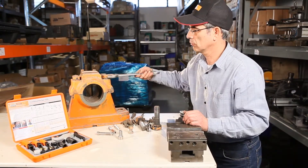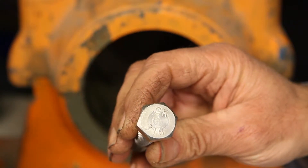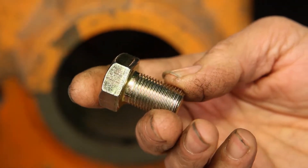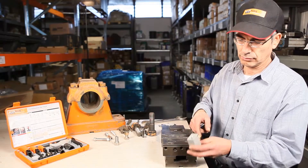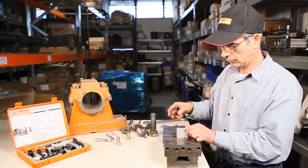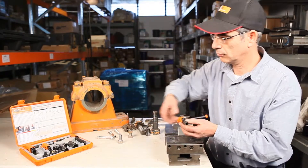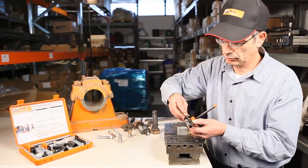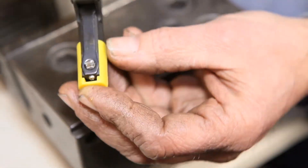One of the first steps that should be taken before starting a job is to know what kind of material is involved. For example, when working with industrial shafts, expect to work with harder materials. In the automotive industry, materials will most likely be made from aluminum cast that is softer and needs to be threaded with care. Internal threads made from aluminum, brass, or any soft metal should be repaired using the internal thread repair tool with the yellow nylon pad attachment.